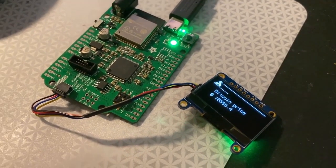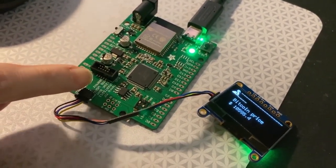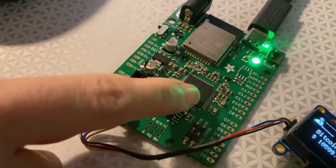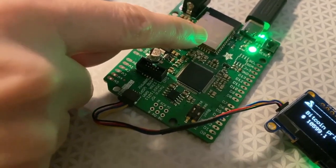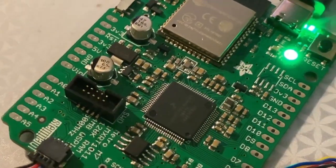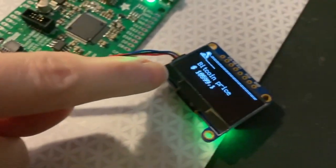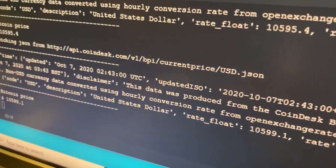Early data — what is this? I am putting together a Metro M7. This is the IMX RT 1011, a pretty cool 500 megahertz processor. It's QFP so it's easy to solder, and it has an ESP32 Wi-Fi AirLift. It's Metro shaped, you've got a STEMMA QT connector so you can plug in an OLED, and I've got it running CircuitPython right now.